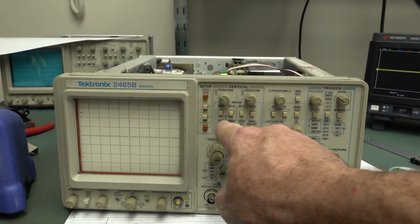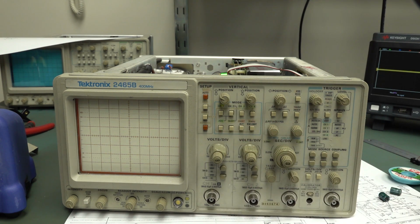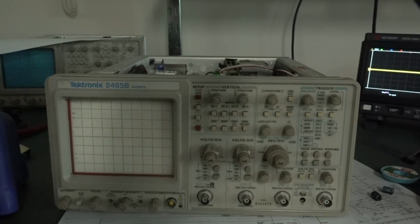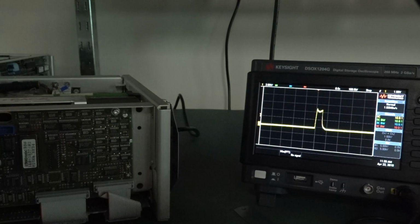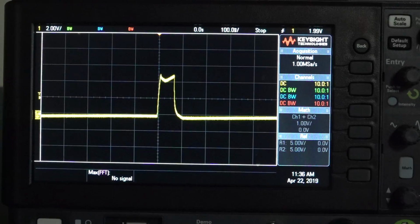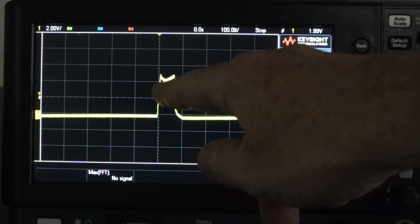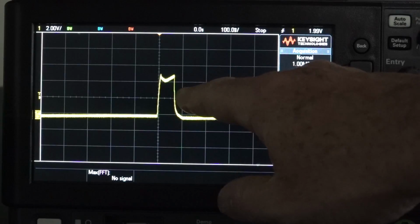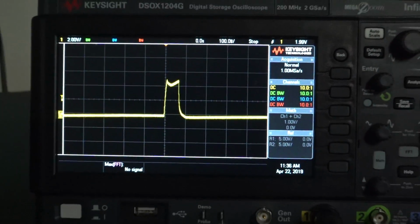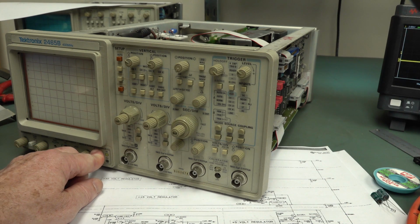and it's hiccuping. Look, check that out. There we go. That's progress. Hiccuping power supply. Hiccup, hiccup, hiccup. Okay, I'm going to capture the 5-volt rail again. There it is. Whoa, that's 2 volts per division. So as you can see, it's starting up at 4.5 volts, and then it basically just shuts back down and repeats every second or two. So that's very interesting.